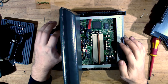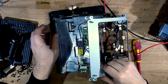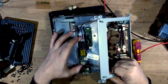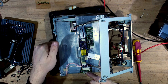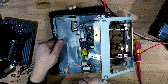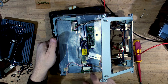I'll figure out where all the screws are, remove the main board out of the unit, and then we can have a look at the circuit board. I've pulled it apart - oh my god. So we'll start with the screen section. This is the back of the screen. You can see the LVDS cable here, and we've also got the backlight driver right here with two lamps. I'm thinking if it works I can replace them with LED ones.